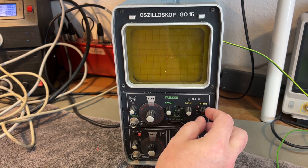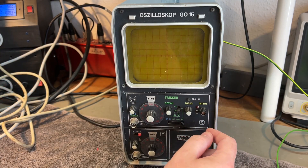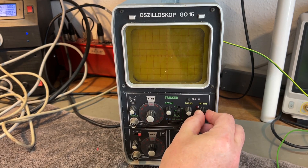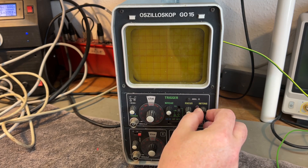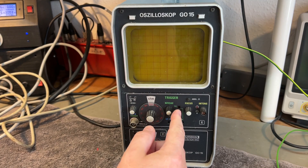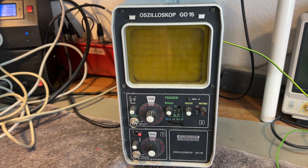I think this is the on/off switch — it's got to be that, right? My idea is, I turn on my mains and just give it 10 volts or something like that. There is just half a watt. Let's crank all this up — internal trigger. Then we will just slowly crank up the input voltage while we monitor power consumption.